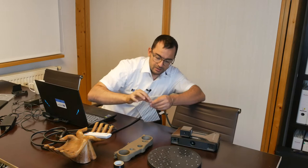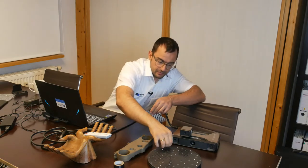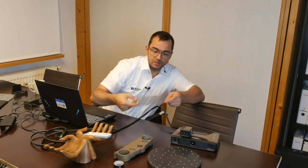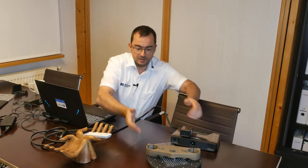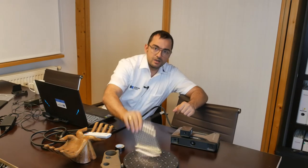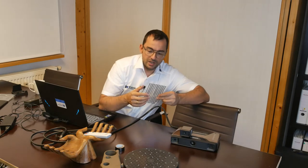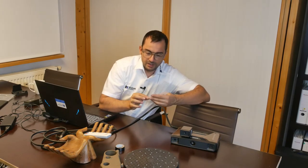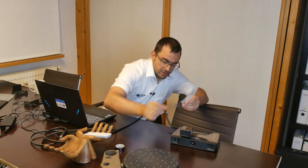Something I really don't recommend is trying to spare markers by applying a full sheet of markers on the turntable, placing your object on it, and trying to scan. The problem is that these markers work like stars in the sky for sailors — orientation is done by their unique position. If there's no unique position, the scanner will always try to arrange that marker field in many possible ways, and this will screw up your scan. So don't do it.